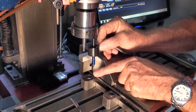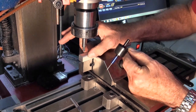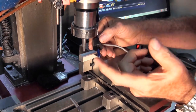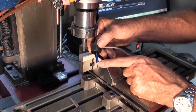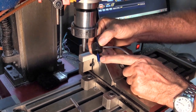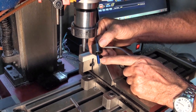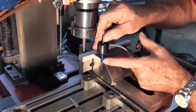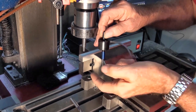I did a whole bunch of tests with dial indicators and fitted a ground parallel — exactly a quarter of an inch in thickness — and there was no way I could get the probe to stop against that edge without over-running. There's got to be some spring in this system requiring force to overcome the spring tension and break the contact. From the limited reading I've done, it talks about calibrating these devices. I know you can calibrate them in the Z axis, but I'm wondering whether there's a calibration process for the X and Y axes as well.